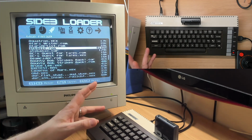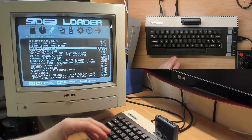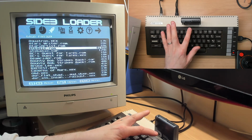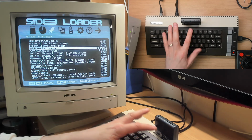The loader can load the images very quickly into memory. But yeah, it emulates most of the popular bank cartridge formats, and we also have the capability to do in-place FPGA updates. We can update the code that actually describes the hardware without a programming cable.